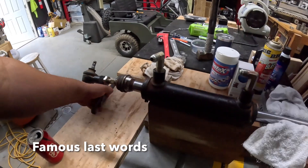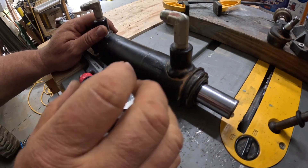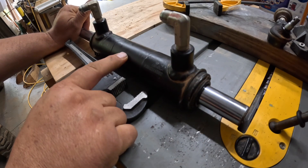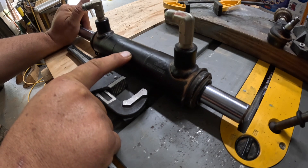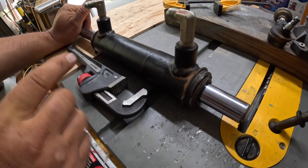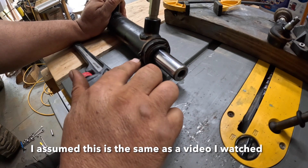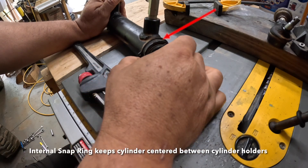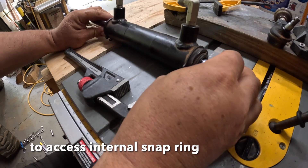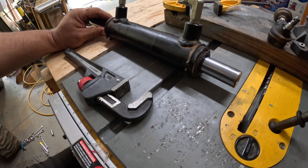Surprisingly it is still very tight — the piston is not going to come out; it's going to stop right here. The reason why is because inside the actual cylinder there are two split rings on both sides: a small one to the inside and then a larger one that have to come off. This will have to be undone in order to open it up. Both sides are going to have to come off because they have components that need to be replaced.